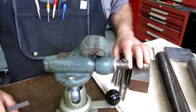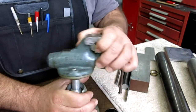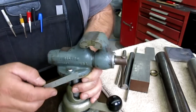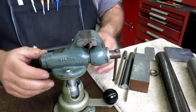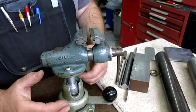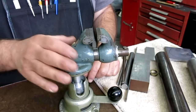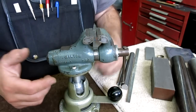So we're zoomed in a little bit closer and this is the little Wilton Baby Bullet here, on one of these omnidirectional power arms that Wilton sold with some of them. This has two-inch jaws — 50 millimeters wide — and it'll open up about two and a half inches, roughly 65 millimeters. It's just a little sweetheart. This is just the iconic machinist vise shape. They don't make this one anymore; the smallest one they make now has three-inch jaws.